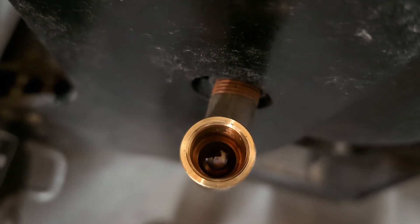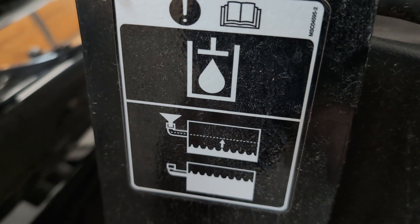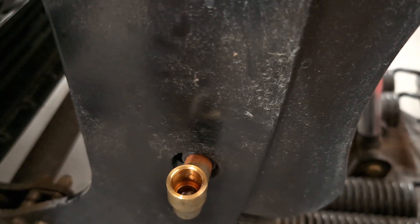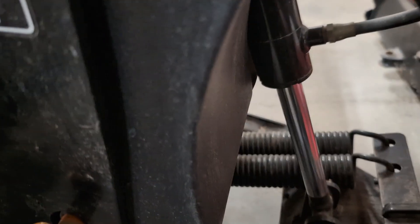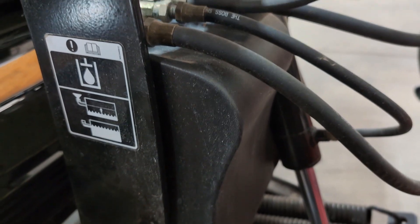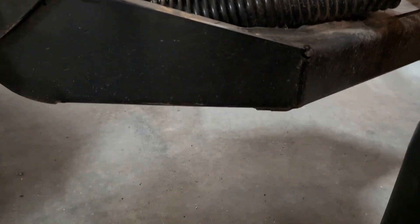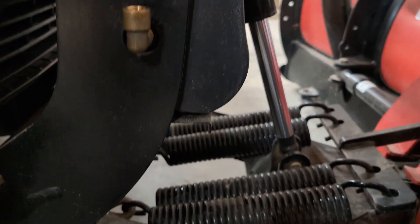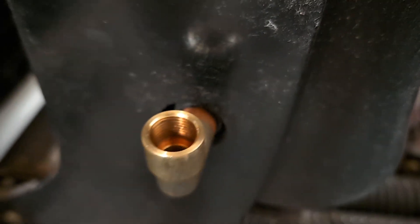I'm pretty happy — I can just see oil on the bottom of that elbow, which, according to this sticker, means it's full. If you overfill this, after you use the plow a couple times through a couple cycles, that breather cap inside the headgear will overflow oil, and you'll see red fluid dripping from the bottom of your plow. So if you overfill it, it's not a huge deal, but it could make a little bit of a mess for you.